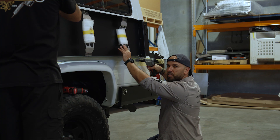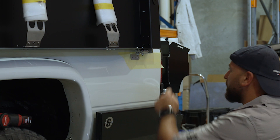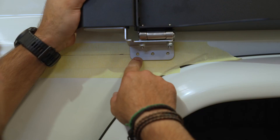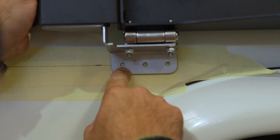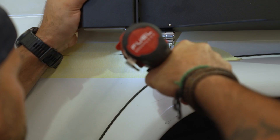Now using the aluminium rivets, we're going to rivet the first one in with the help of someone. After riveting the first one, we're going to swap sides. The next step, we have to make sure our straight line is sitting in the middle of the holes on the brackets, and then holding it in place we're going to drill.